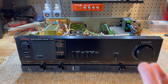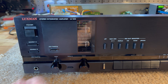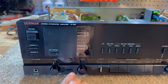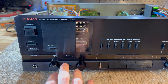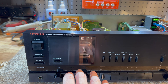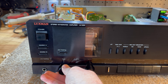The tone section can be switched in or out — it's not always in circuit. When you bring it in, the noise floor increases significantly, which is a definite weakness. If I were to guess, replacing the resistors on the tone board from carbon to metal film might help, as might the pots which are very hard to get right. But since I don't use the tone controls, I've left that alone.